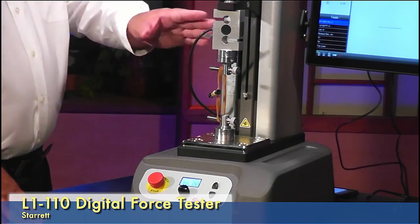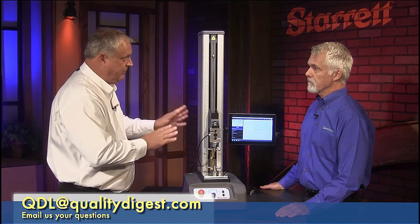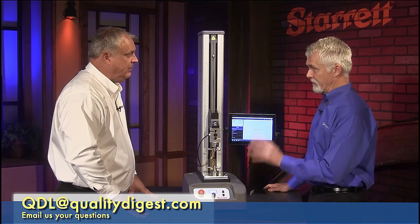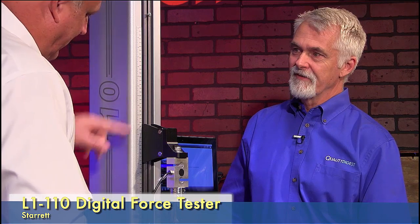Now, when you're in the L1 configuration or the DFC, no matter what speed you have dialed in here, either the gauge will override it, because the gauge is controlling the stand, or the software will tell it to do whatever. So this is strictly if you're running in manual mode. You don't have anything else hooked up to it. You're just going to manually move the stage yourself. And I guess also in manual mode, you've got a distance scale off to the side. Yeah, that's pretty much how you measure how far you went with the little scale on here. In the other two modes, we've got the encoder on the inside, so the gauge reads the feedback from the encoder, or the L1 software does as well. So that's how it judges speed and distance and everything.